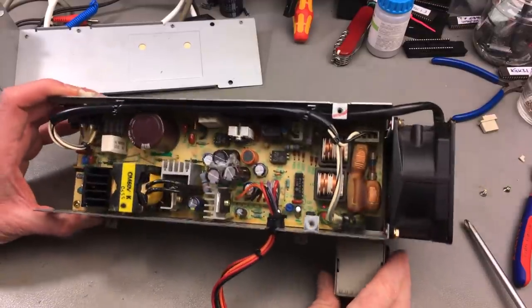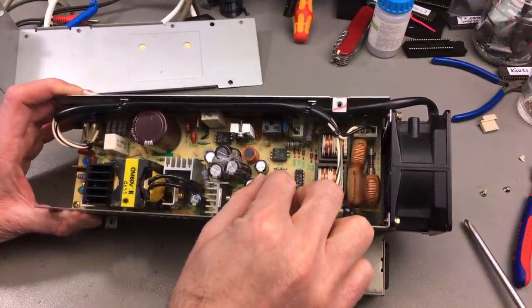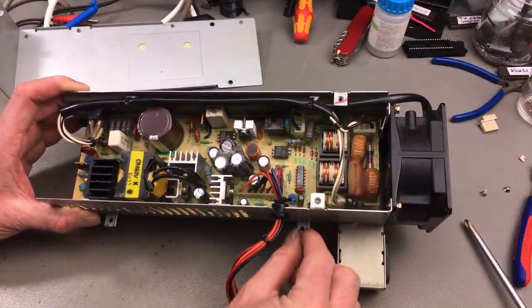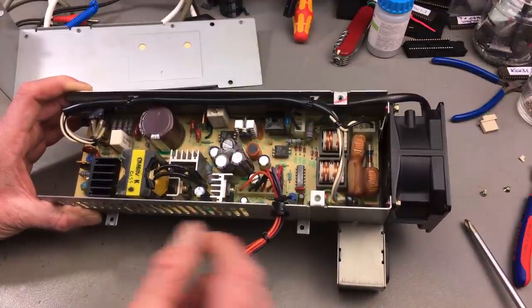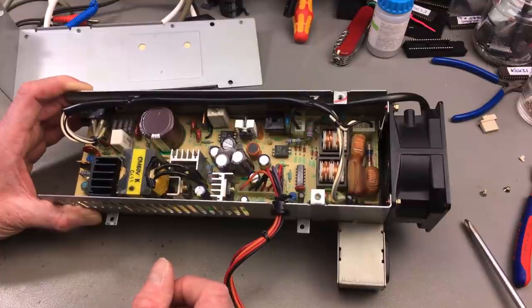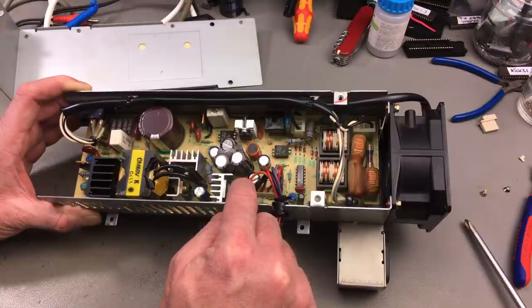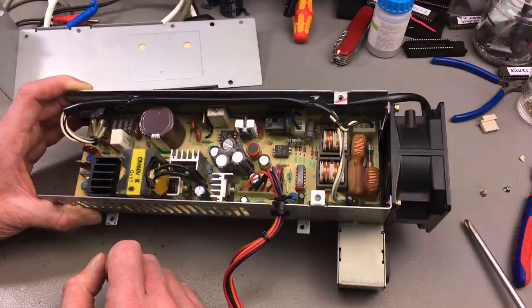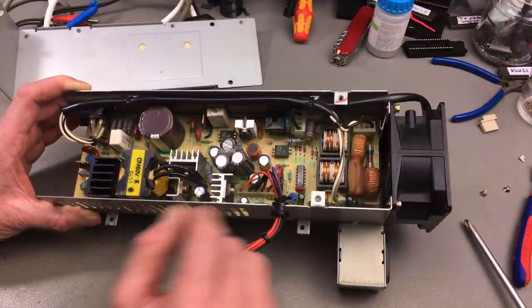So I actually want to do this kind of properly, and there's no way we can solder to the top part here. So I guess there's a small gap underneath the circuit board. There's a small gap to prevent high voltage from getting to the case, I guess. And we are going to solder wires from the bottom side and run them out on the front here somewhere to have a nice place to connect the fan, I guess. I think that's the way to do this.